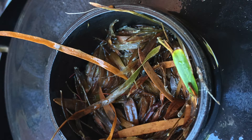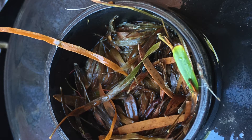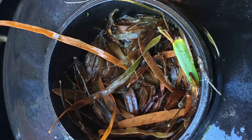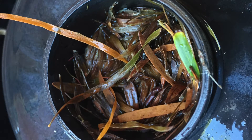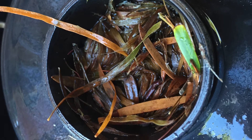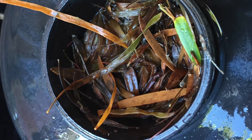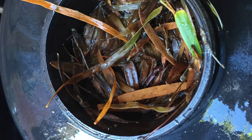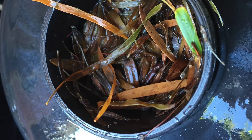So why does this happen? The reason you have a lint basket up at your swimming pool and another one down in front of the pump is so the leaves and bits and pieces — the debris — don't get through and block your impeller. My guess is that someone decided to vacuum their pool, or even vacuum to waste, without the baskets in place, thinking they won't have to empty the baskets that way. Problem is, it just blocks the impeller. Most likely someone ran the pump without the baskets, or did a bad emptying of the baskets with a lot of leaves behind — but this one looks like it's been run without the baskets, which of course causes this blocking.